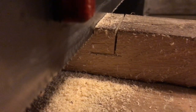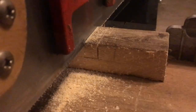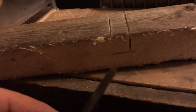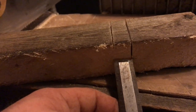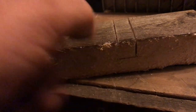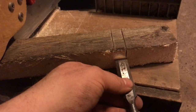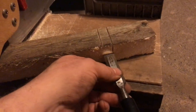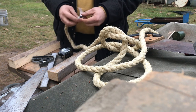To cut the trough out for the rope, I'll cut down three-quarters of an inch deep at three inches from the top and three and three-quarter inches from the top — that gives a rectangular trough. When you have both cuts down to the line, take your wood chisel with the flat side down, set it on the line, and give it a little tap. Clamp it first, then drive the chisel in from the other side and it'll just pop out. Use a wood mallet — you don't want to use a metal hammer on your wood chisels.